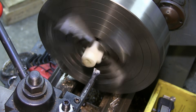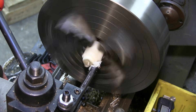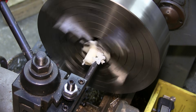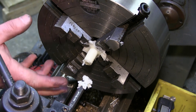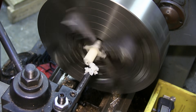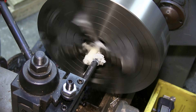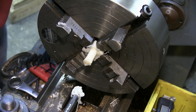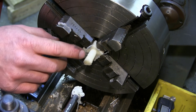There we go. Yes — chip formation is fabulous. No lube. If you mess around with it long enough, you'll find that you really don't need any lube. It's just a matter of taking that extra little bit of time to get everything all warmed up. Juicy. I'm just going to go ahead and take the spring cut. Oh yeah, lovely. Now here's what we don't like to see — we've got a bit of a gland end on here. It's bulbous. I don't like to see that myself.